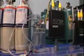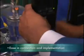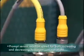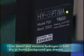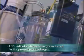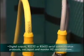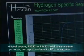Here are some of the High-Optima 700 demonstration highlights: the ease of implementation and connection of the sensor into operation; fast real-time reactions reported both digitally, graphically, and through the analog outputs; the prompt reaction speed for both increasing and decreasing hydrogen concentrations; the ability to detect and measure hydrogen in both dry or humid background gas streams; the LED indicator on the front shines from green to red at the initial indication of hydrogen; and lastly, the digital output using the RS-232 and RS-422 serial port can report and monitor hydrogen concentrations in real time.